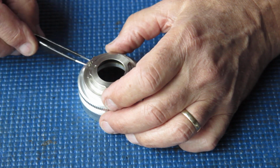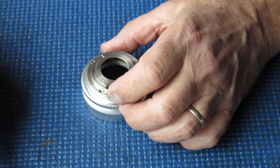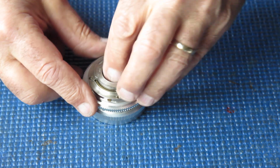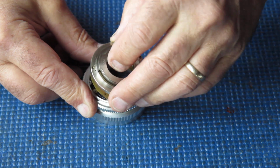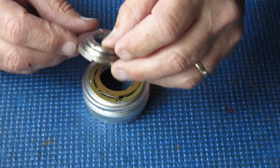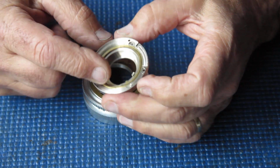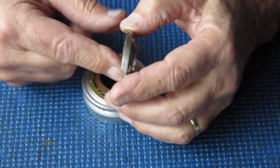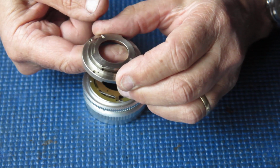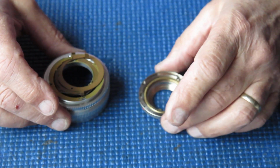And these screws are longer than the ones that held the front of the lens. And now we can lay the pieces out. I'll lift these off in order. So we have the lens mount. The lens mount here contains a little brass wedge in here for all practical purposes. That's a cam that works the rangefinder on a Retina 3S camera. That's the first piece.